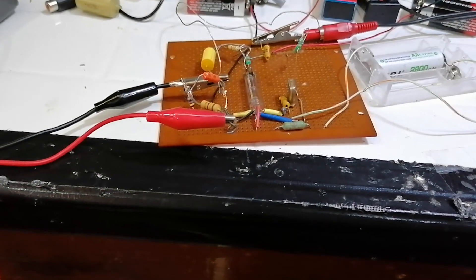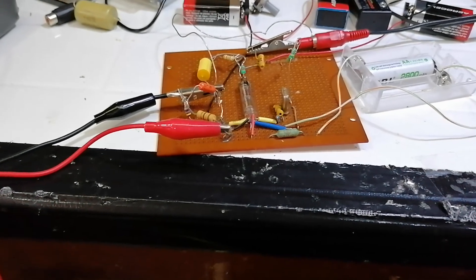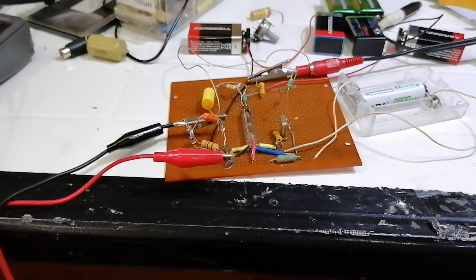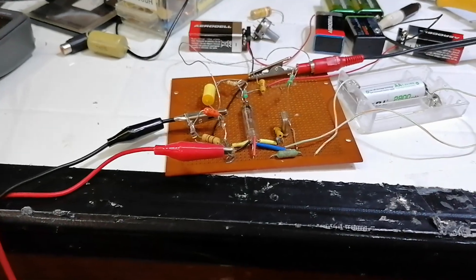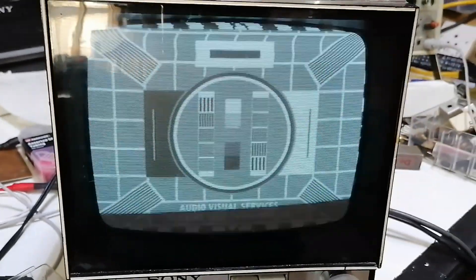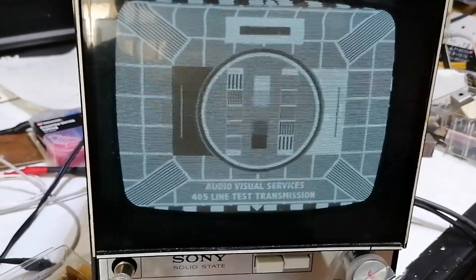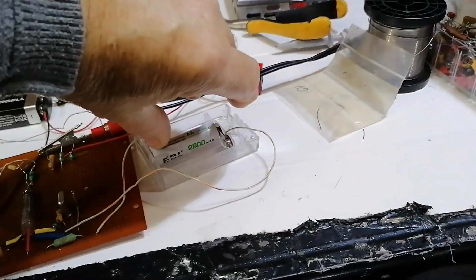As I explained in the previous video when I did the pantry transmitter, I had another crystal at about 42 MHz and got nice audio. So if we could get crystals of the right values made up for this, you would have a simple enough valve modulator for channel one. I'm going to get all the bugs sorted out — this is just the preliminary stages. It's thrown together, it's tacky, not very nice looking, but it proves the fact that it works.